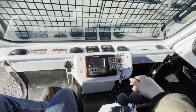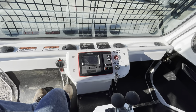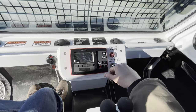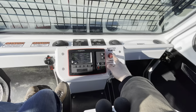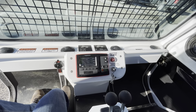Nice engine display — let's turn this on here for you. It's a color display. When the engine's running, it'll show you all the diagnostic information for the engine as well as the machine hydraulic temperature. We've got an audible alarm as well as a visual alarm, which will trip if the engine is getting hot or the hydraulics are too hot or something like that.